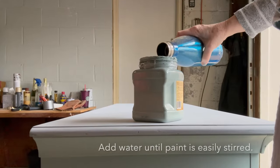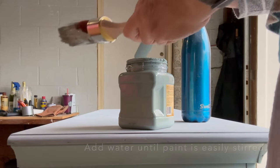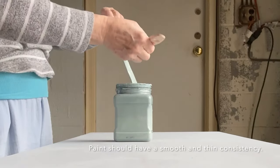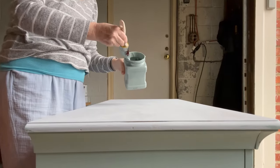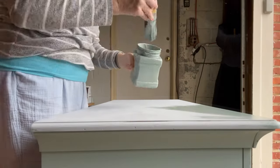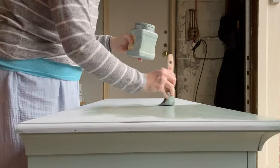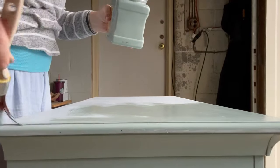Here's a great tip on how to get a flawless smooth finish: add some water into your paint and stir it well before applying over the primer. When I apply my paint, I apply it first in multiple directions, and then at the very end I go back and forth in one direction. This is called cross-hatching — you do one direction, and then you go back and do the whole piece in another direction.